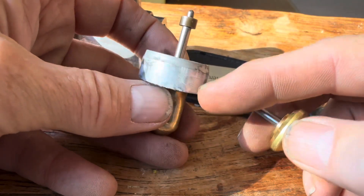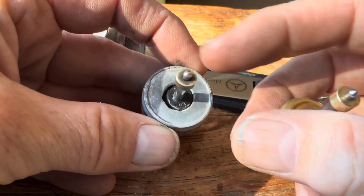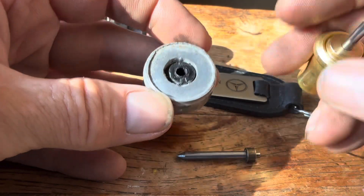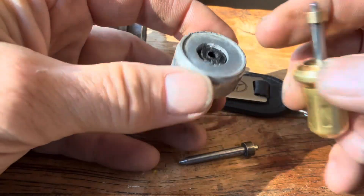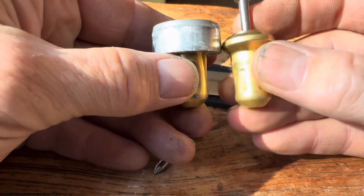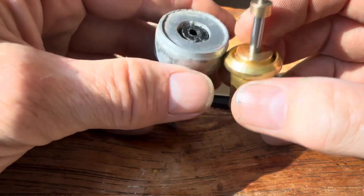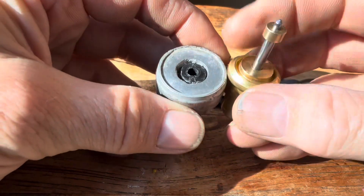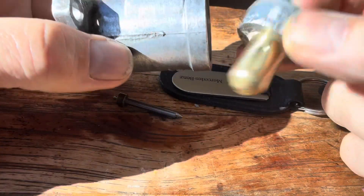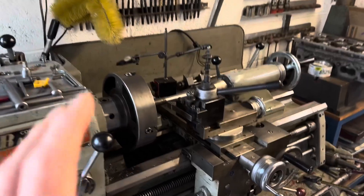What I'm going to do is give this to a machine shop to see if they can take this washer out and possibly make me a new aluminium part. The way you would get this out without a machine shop is to take this rod out and then try and wedge a screwdriver on there and pry it up, but nine times out of ten you'll end up damaging it. So what I want to know is whether we can just manufacture these two pieces and turn them on a lathe — because on these new bulbs the diameter of the top bit is more than the diameter of the plastic bit on the old bulbs. So we'll manufacture one, drop it inside, fill it with some kind of high-temperature sealant and then press this back on — and that should be ready to be pressed back into the casing.